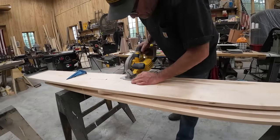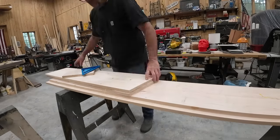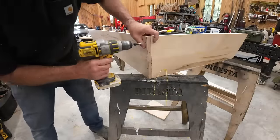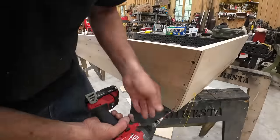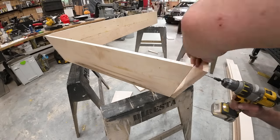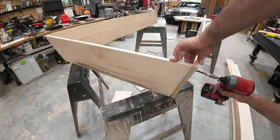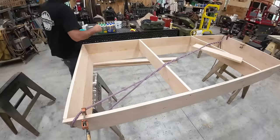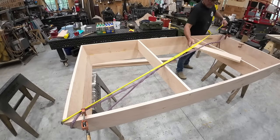This is a little bit of a rough assembly only because it all gets hidden — it all gets a whole skin of walnut over it. This is where your circular saw skills come into play. All this wood needed to be pre-drilled because you snap screws into it instantly. Everything had to be pre-drilled and glued — it's a type of wood that would ruin your countersink because it's so hard.